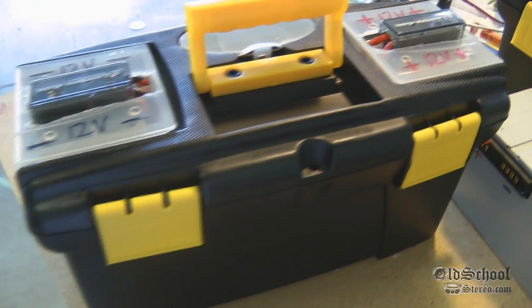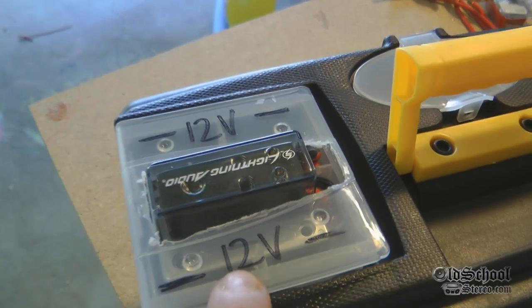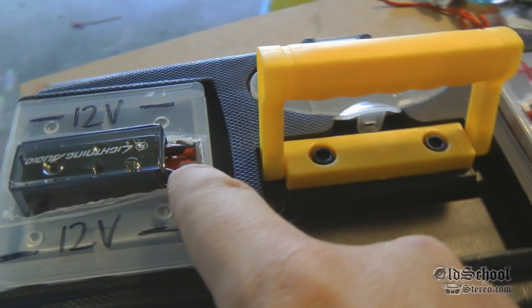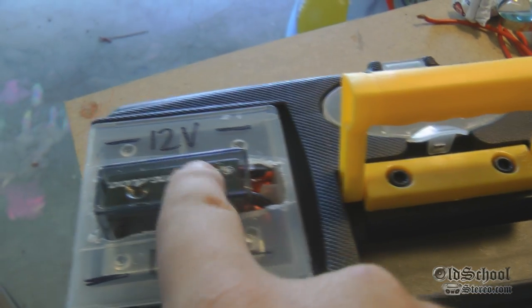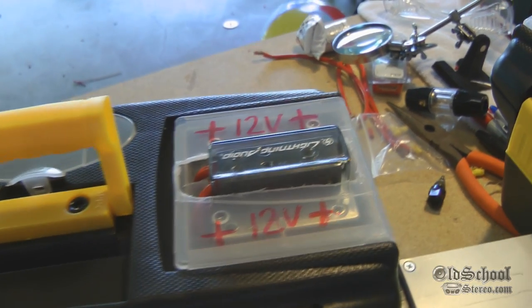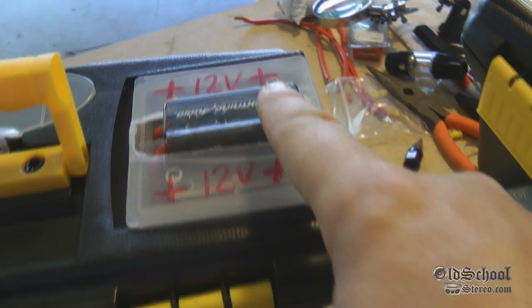I'm going to show you one that I made — this is kind of my first generation. I decided on a couple things I'm gonna do to make it a little bit better. As you can see we've got the minus on this side and we have 10-gauge wire — four 10-gauge wires coming into the single distribution block. We'll be able to hook up 4-gauge wire on the end, though we probably won't need 4-gauge for 50 amps — 8-gauge will likely be fine — and here's the 12-volt plus.